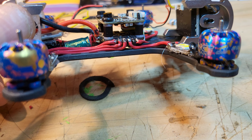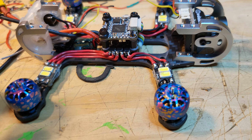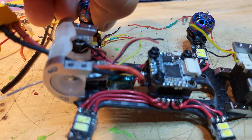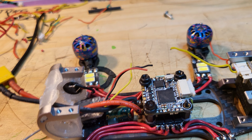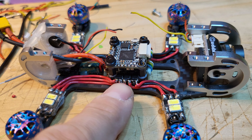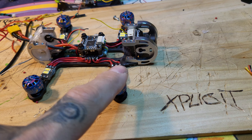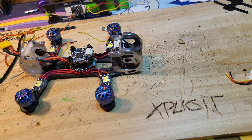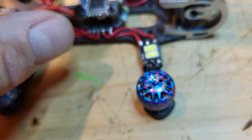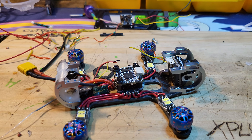I got these kick-ass motors — 1105 6000KV. Can't find them pretty much anywhere anymore, so he's got a killer deal. I love these things; they look like clown wheels. One thing I do — and it's just my OCD — when you're building, it's three wires, and whatever way you wire those to the ESC, the motor will spin a certain way. In Betaflight, when you set up the quad, if you want prop-in prop-out, that is based on how you wire it. I don't go into BLHeli and just flick a switch to reverse the motor. I'll just take the time to flip-flop two of the wires if any motor doesn't spin in the intended direction. I prefer to do it that way — one less thing I have to do on the computer.